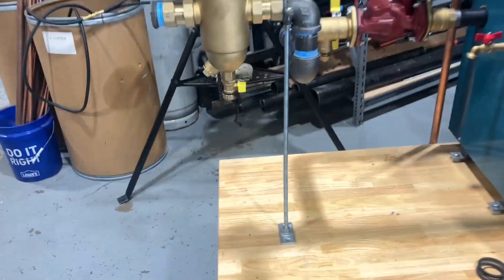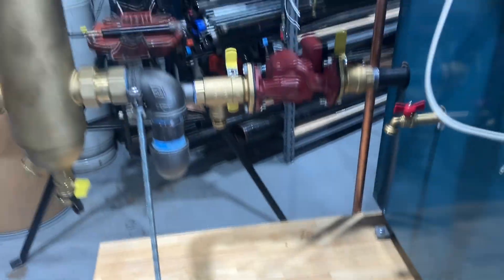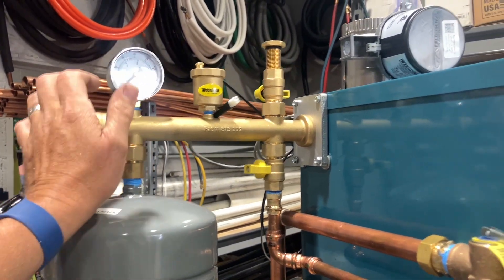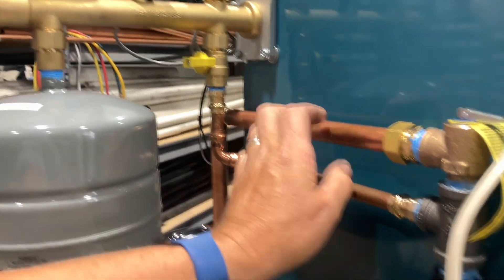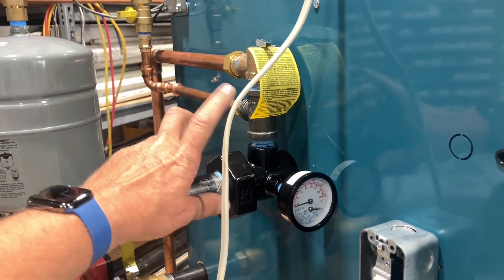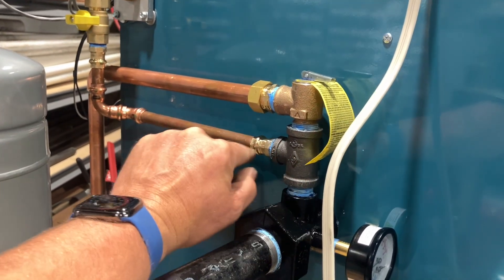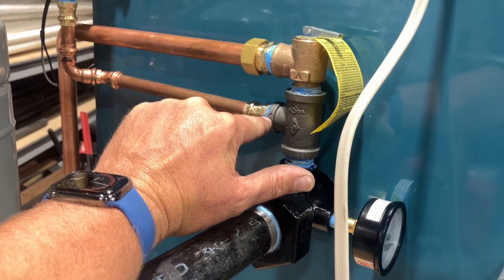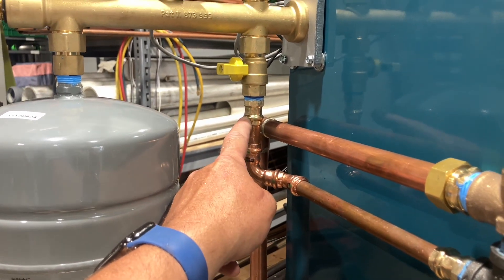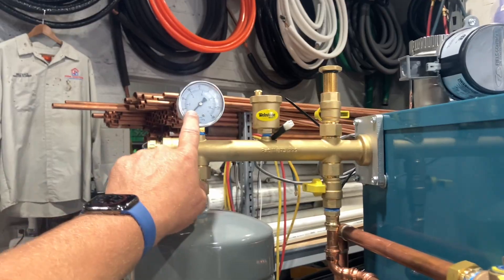We accomplished a lot this afternoon. I put a piece of threaded rod with a split ring hanger to the floor plate. We also hooked up the Webstone Easy Tank Manifold — this allows you to bring system water from the top or from the bottom. Off the factory-supplied field-installed manifold block, I added a T with a nipple, and then our 30 PSI relief valve came out with a three quarter by half inch black T, street 45, regular 90, a little piece of copper, and a press male adapter going to our expansion tank assembly. We have the automatic air valve and a pressure gauge.